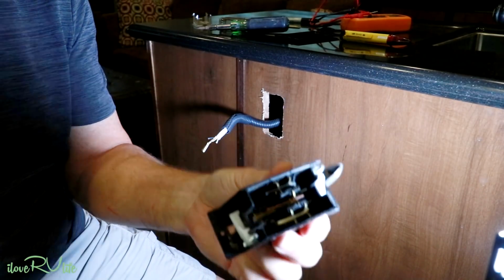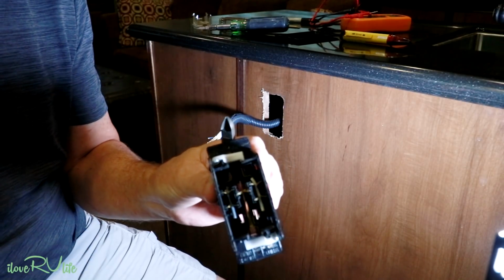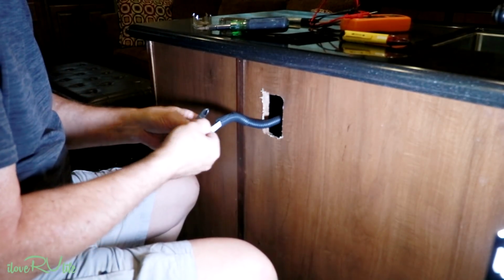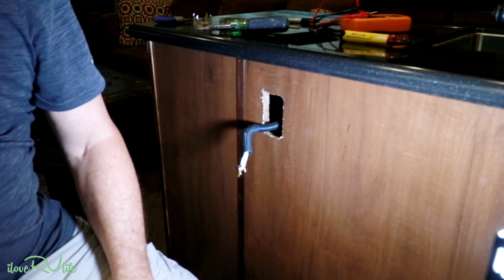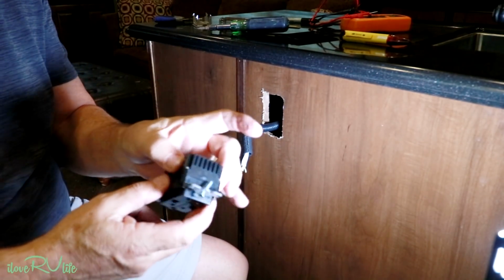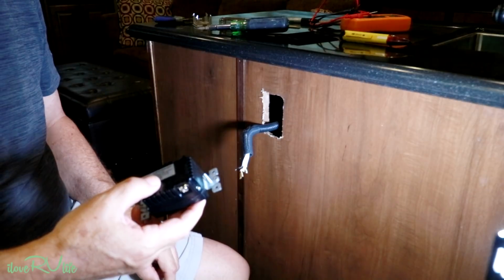See this? See how it's, try to get it here in the light. You see these wires are just stuck in here and these little doodads. I don't like them. They just scare me to death. I just don't think it's a good thing. All right, now, if you notice, I've got this receptacle here, and I have nothing to put it in. Besides, I will have exposed terminals back here on the sides, and somebody could stick their hand back in here doing something, get electrical shock.